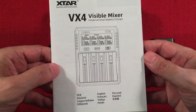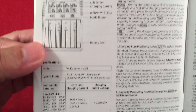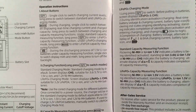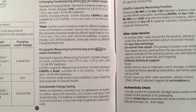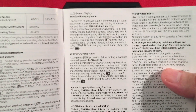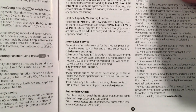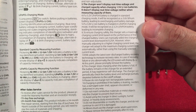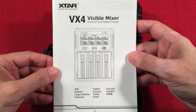We get a manual with multiple languages — going to English for a quick overview. I'll just scroll through quickly; freeze frame if you need to. I'm going to focus on charging standard battery types — nickel-metal hydride and 1.5-volt lithium — and not get into the lithium iron phosphates. There are two modes: a charging mode and a capacity-check mode, where it charges, discharges, and charges back up to give you a capacity result. They're proud to be first to do that for 1.5-volt batteries.